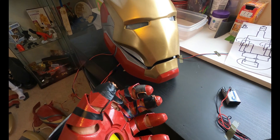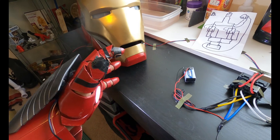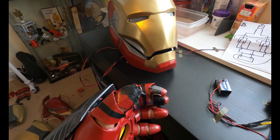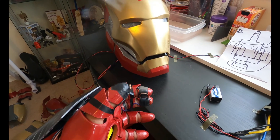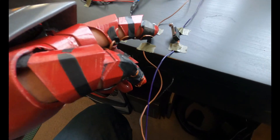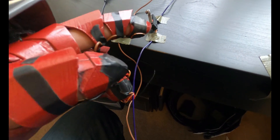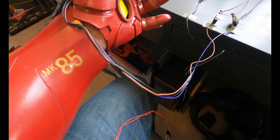The gear is stripped out because I hot-wired the servos to just run DC open/close — there's no limit, nothing to tell the servo to stop. I had to figure out a way around that, and luckily this relay system does it. These two little limiter switches are actually interrupting the triggers to my fingers.